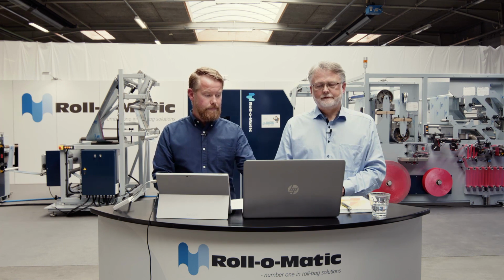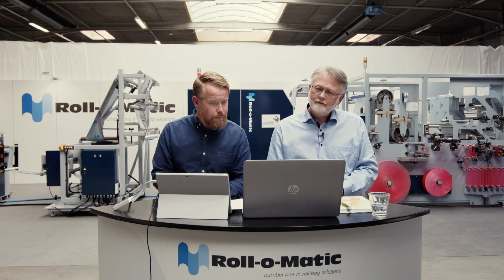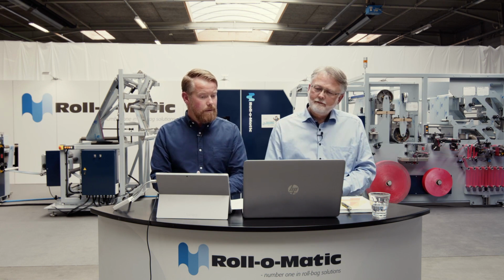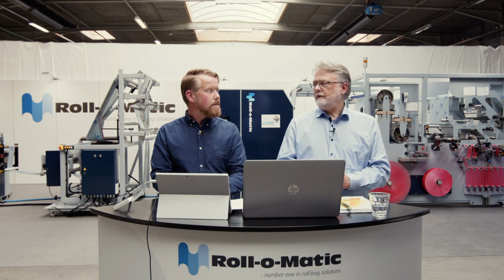Next question: John, will you be able to seal a 2 mil repro bag, and at which speed would that be possible? Yes, we certainly will. 2 mil is approximately where we run maximum speed on the line, which would be 160 meters a minute. Of course, repro could be many different types, but regular, good quality repro would be able to run 160 meters a minute, yes. And that's again because we have the heated sealing systems on both sides of the film. Okay.